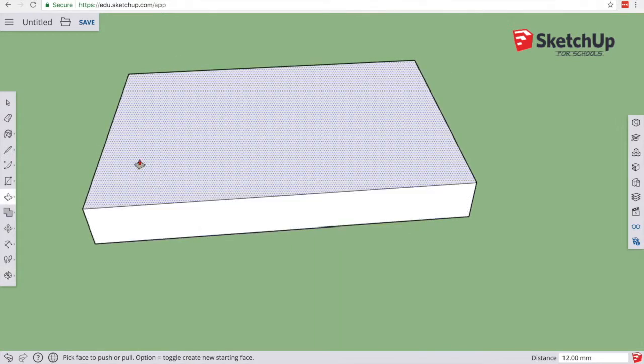We're going to create our rebate on this end here. I'm going to do it in two ways. The first way is very much like I would do it in real life on the real piece of wood, just to get the idea, and then I'll show you how much more quickly we can do this in SketchUp. The first thing I'll do is measure a distance from the edge of the wood that is 12 millimeters in and get a line going across — this will represent the width needed for the other piece that's going to slot into it.